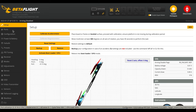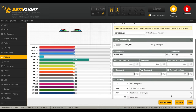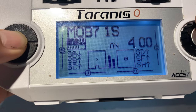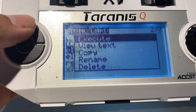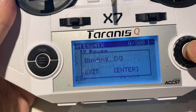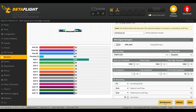We're going to plug this into Betaflight, go into the receiver tab, and click 'Bind Receiver.' On your radio, you need to open up the Express LRS LUA script — this one is the V2 with the 2.0 firmware, which I'm still on — and go to bind.